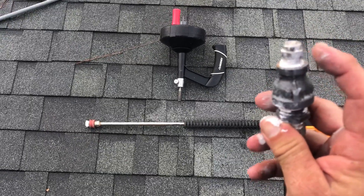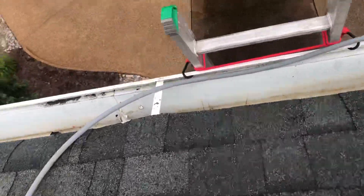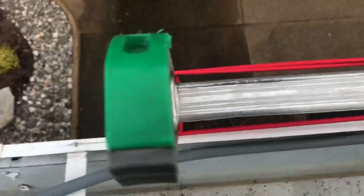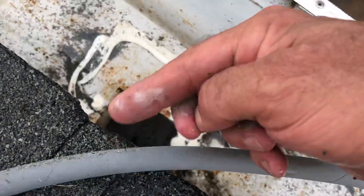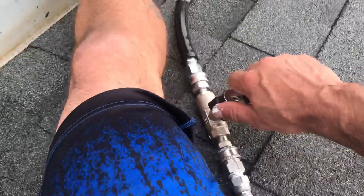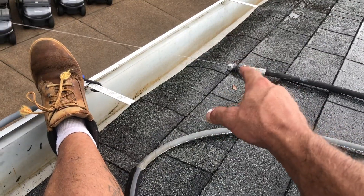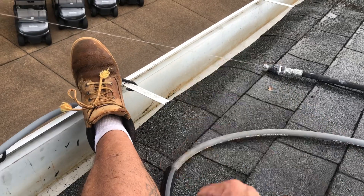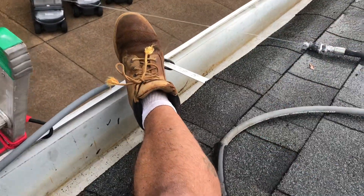So I made this end permanent so it would not pop off. I threaded it in there and snaked it inside the drain. I was standing on the edge of the ladder and I was able to snake it all the way down to that elbow. Once I got it to the elbow, I turned my ball valve on — the pressure washer isn't running now, this is just water pressure from the building's faucet — and it blasted everything out. It was trash, all kinds of stuff coming out.